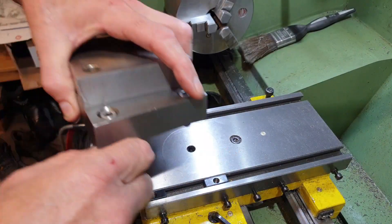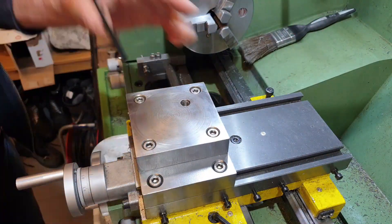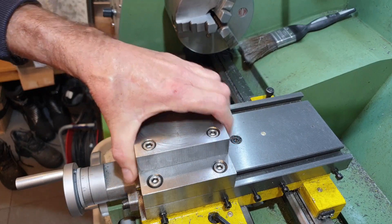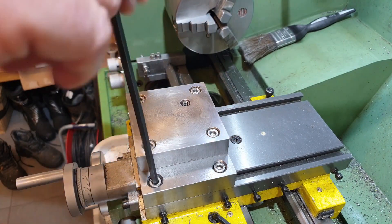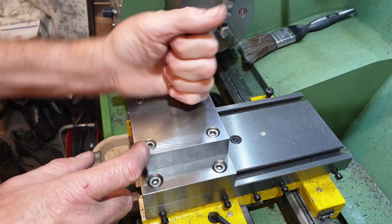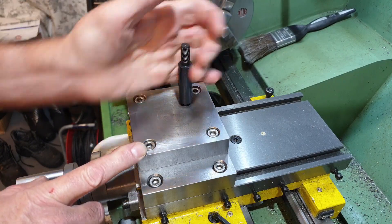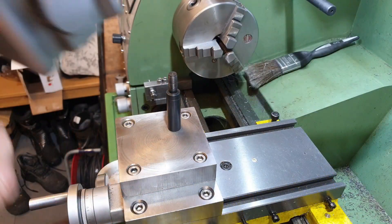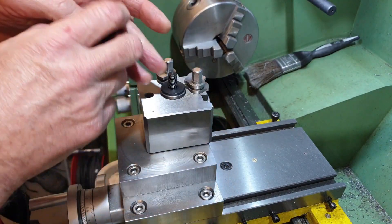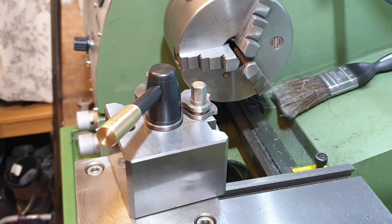So the two T-nuts are in the slots. Let's just build up the tool post. I am thinking about bluing both of these blocks as well, but it might just suck too much light away from this part of the lathe, in which case I'll need to rely on just keeping them well oiled. First is the tool clamping post — the previous post was well and truly Loctited in position and it was not easy to get out. I will Loctite this one in as well at some point. The quick change tool post itself is from one of the model engineering suppliers in the UK. Then the washer, the clamping nut, the handle and the cap. I'm very pleased with that — that looks great.